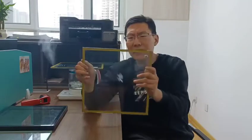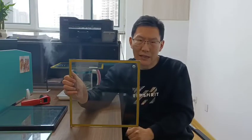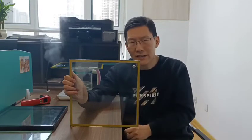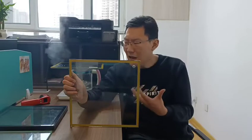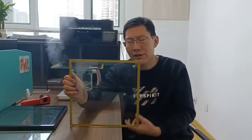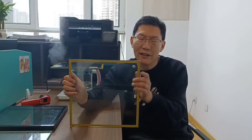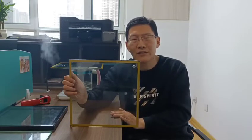The vacuum glass looks like a laminated glass, but it's quite different. The biggest advantage of vacuum glass is its low thermal conductivity. The double glass unit with double Low-E has a U-value that is always around 1.6. With the development of triple Low-E, the U-value cannot be decreased further with the original structure. But with the vacuum glass structure, the U-value can be decreased to 0.6, 0.5, and even 0.4.